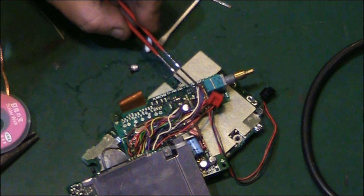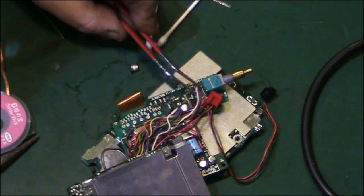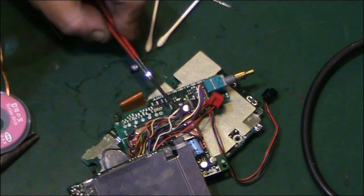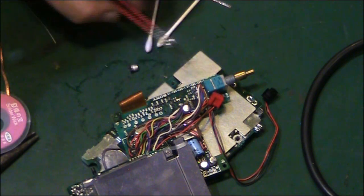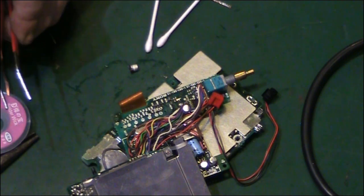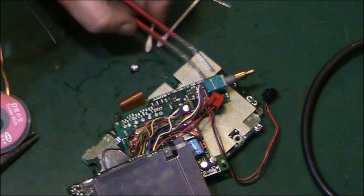I know I said earlier in the video that I really didn't want to have to, but I might even disconnect that and disconnect that, take them completely out of the way just so I can get better access to this part of the circuit to clean it up properly. We may even end up lifting the IC off, cleaning underneath it and putting it back on. We'll have to do a lot of continuity checks around here because there is really quite a lot of corrosion